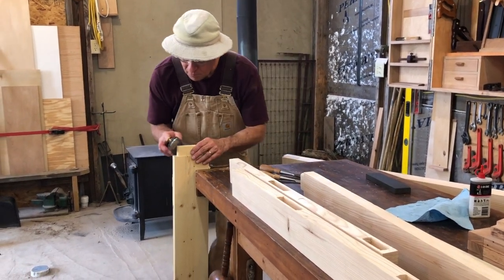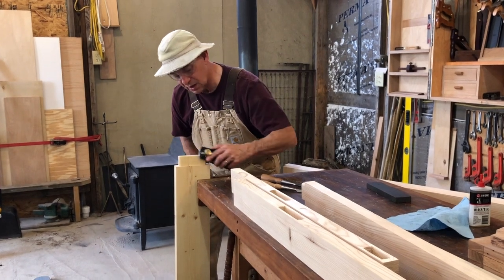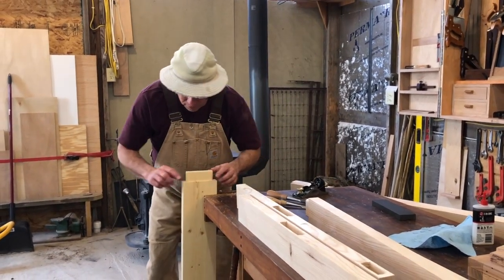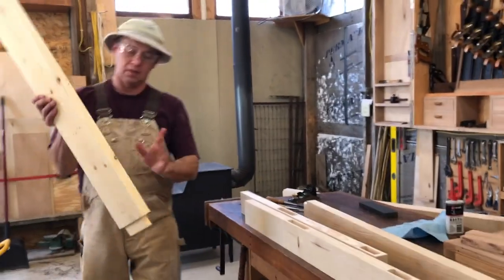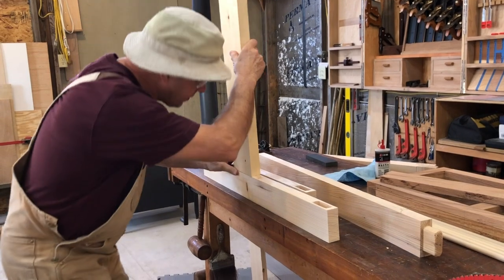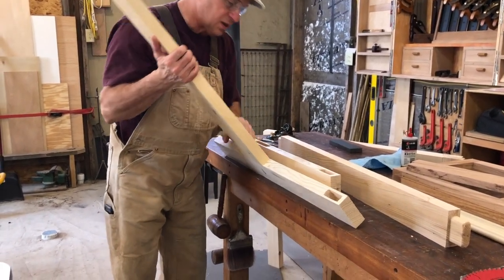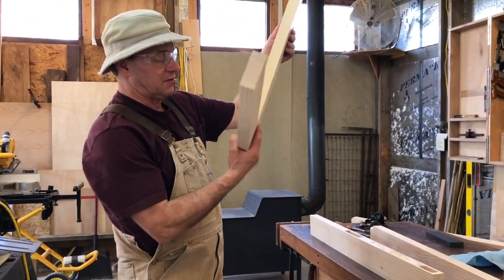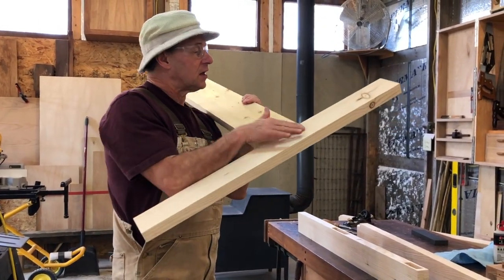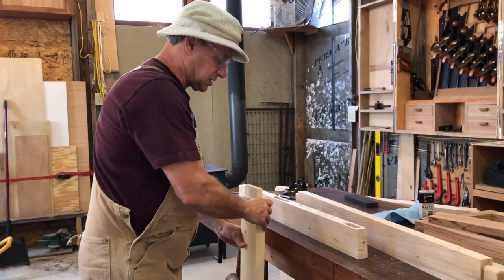I'm going up against the grain carefully — if not, you can tear out that soft grain. Let's give it a shot. We're going to put any defects toward the bottom. Oh yeah, that fits so much nicer. Remember when you do your mortise and tenons, you want it to fit snug — it's not going to come out — but you don't want to have to drive it in. The last thing you want to do is crack an end or a side because you put too much force. That looks pretty good. I'll finish this side and put my rail and stile in and we'll be good to go.